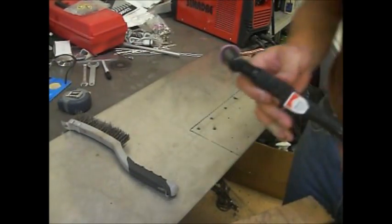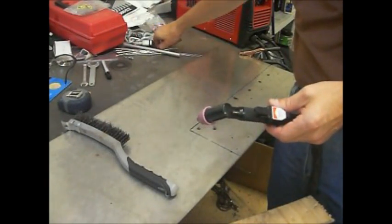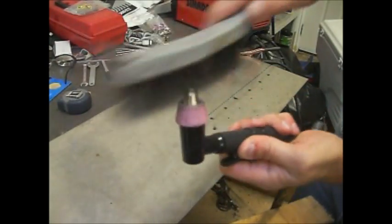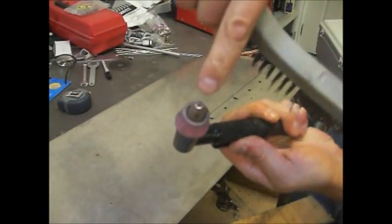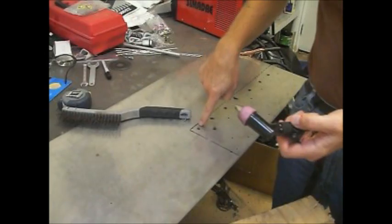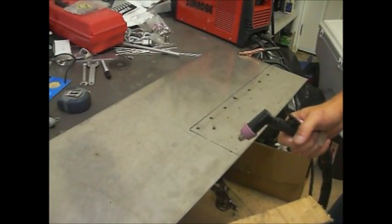One thing I've learned with plasma cutting, especially on coated surfaces, is you really have to use a ventilator because when you're cutting metal with paint on it, that paint does all kinds of weird stuff. If you look at the tip, you get some junk coated on it. The best thing is to use a wire brush in both directions, since there's usually an X pattern at the bottom, then take a little drill bit and spin it in there for a second. If there's any junk in the tip from marker paint or whatever, that'll fix it so the torch starts nicely instead of having a hard time getting the plasma flame to light.